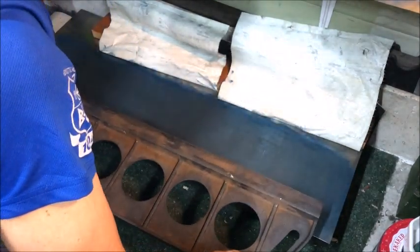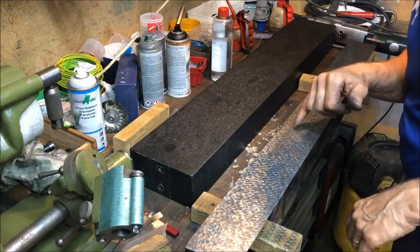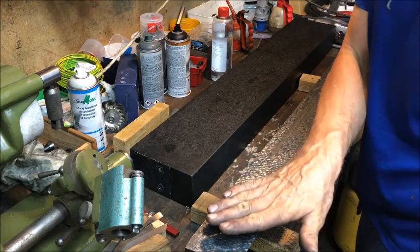So, turn it around now — 35 strokes, much less blue. Some crosses, reduced speed, reduced stroke length. Still have a little bit of an area here and a little bit of an area here, but yeah. Applied light coat of blue — I still have a stripe here that is not covered, and here — otherwise quite okay. I went over to crosses.